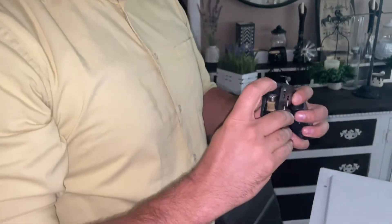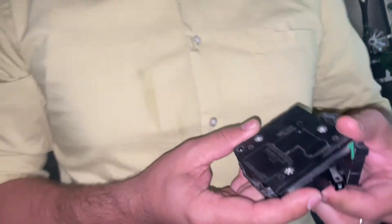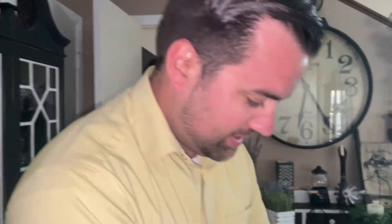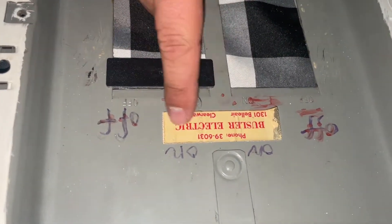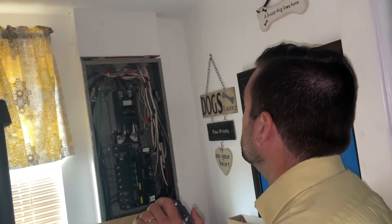If I hold the contactor here — Murray doesn't really have a date. Looks old. And given the fact that it's made in the USA versus — what is this? Mexico. This is an old panel, like I pointed out earlier, this electrical panel passed inspection. I've always kept this old sticker that has a six-digit phone number — predates area codes and everything. Whenever that dates from, it's sixties I guess. House is a '64 or so. Panel is more than likely all original. Point is, probably an old breaker. So I'm going to slap this one in.